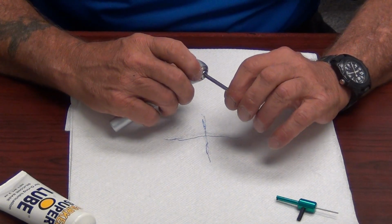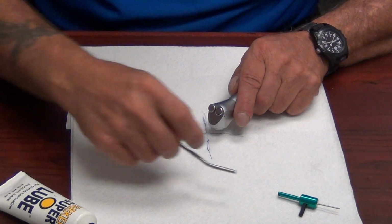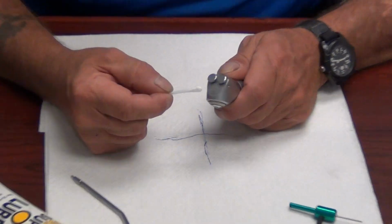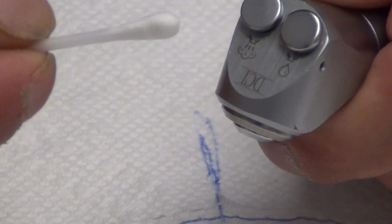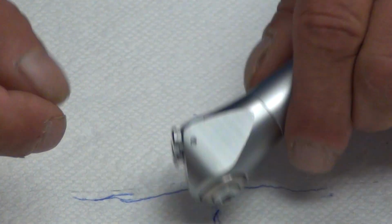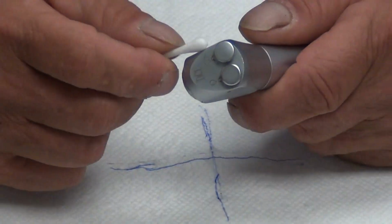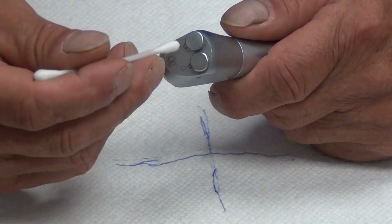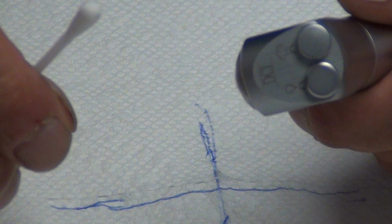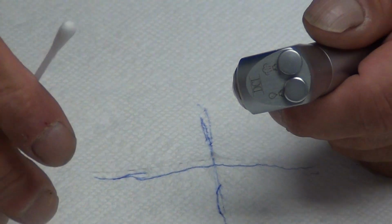The only indication that you cannot repair a syringe is to examine the head of the syringe closely. Look for any dents or dings in the head of the syringe, especially around the buttons, that could impede the buttons or make the buttons stick. If the syringe is dropped, which happens quite often, they miss putting them in the hanger on the unit and they end up on the floor, it will actually dent the head of the syringe. The dent will reflect in the button port and will make the syringe inoperable. That should be the only time you sell a new syringe. In case the doctor just out and out requests a new syringe, by all means put one on.